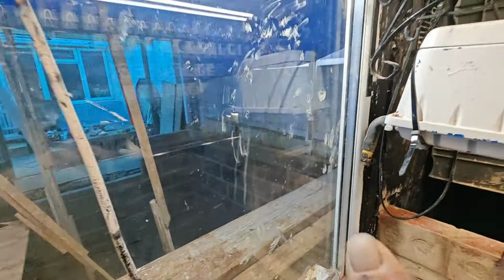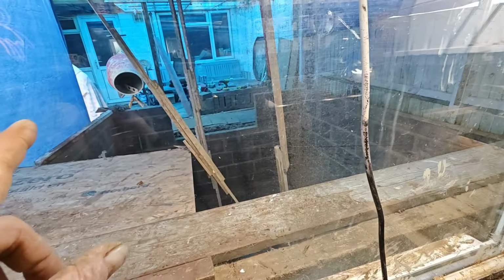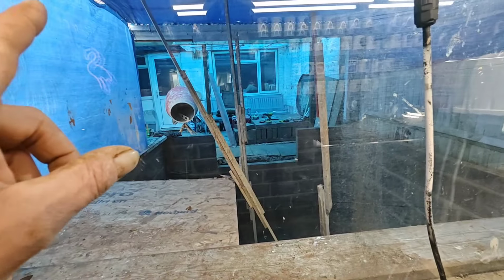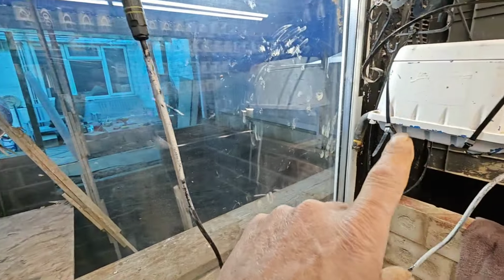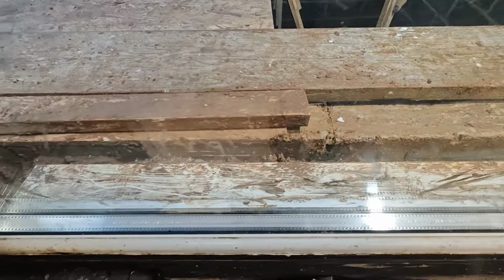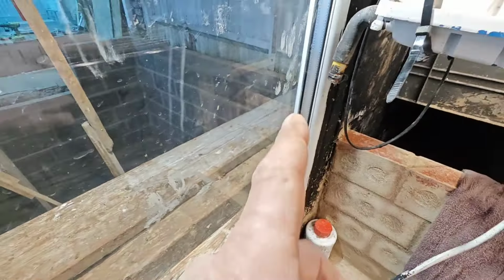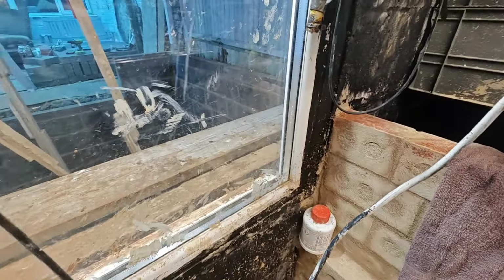But next jobs are out there. We've got to get that membrane up against the fence. Got to get some bags in so Susan can get them stamped down in front of there, and then I'm going to start making up some concrete to go and start securing these corners before we bring the clay back in. As you can see, we've hit our level there and we still got to go across, but I want the concrete in that corner before I put any more in. So yeah, that's what we're at next.